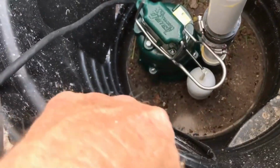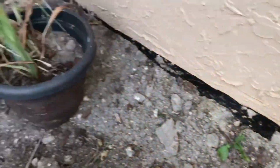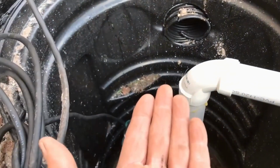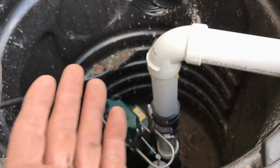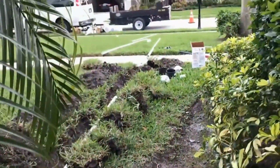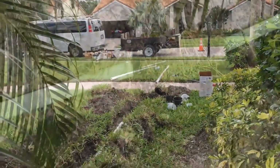We've got another one on this side. So we're picking up all the walls. You can see it comes all the way around that bay window, and around here behind me as well, goes all the way around to this corner here. As groundwater rises, it comes into the system, into those perforated pipes, as well as our sump basin. We've perforated around the side of the basin, and that will allow groundwater to come in as well. As that groundwater rises, it floods into the pit. The sump pump lifts it up and sends it out to a discharge point a good distance from the house, but it will eventually get into the gutter system of the street, and that's where this water belongs.